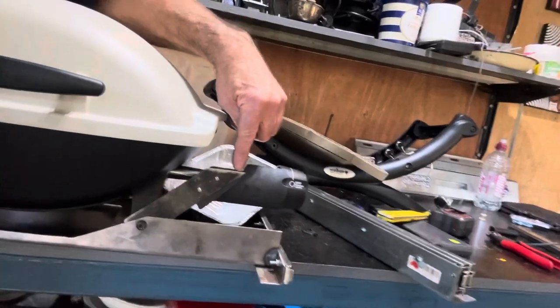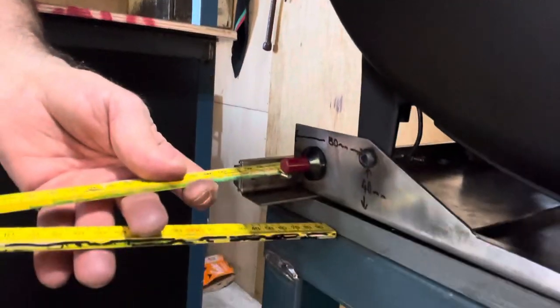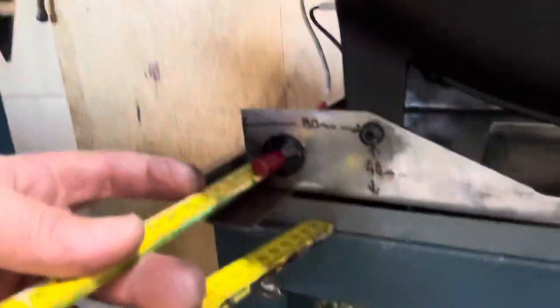The easiest way around the offset would be to buy a piece of 5mm aluminium flat bar, cut it to shape, drill it, and use it as a packer in between the metal and the plastic where the manifold is attached. Then, all I did was measure back 45mm from the edge of the start of the runner, and welded the angles on — 45mm back on both sides.